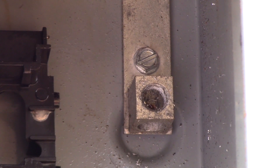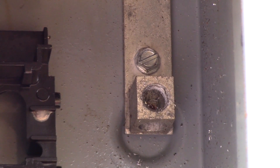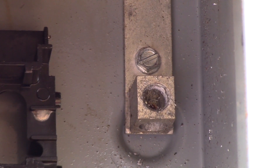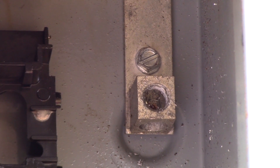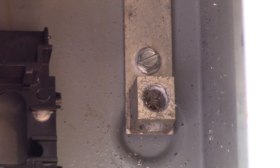With a little luck and some drilling, I was able to drill out that set screw out of that terminal lug, and I was able to rob a replacement one out of my panel at home. So now I'm going to be able to clean up these connections, put some DeOx on them, and then do some checking and turn the power back on here.